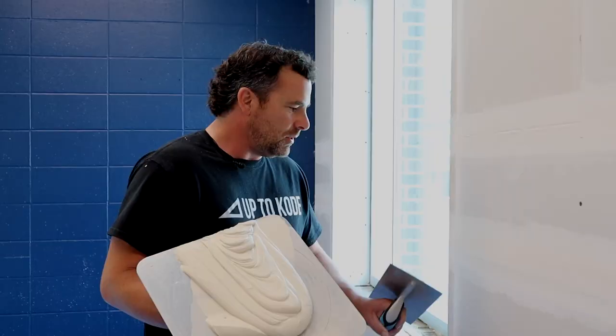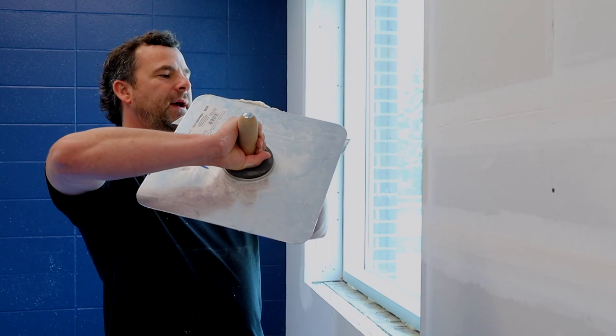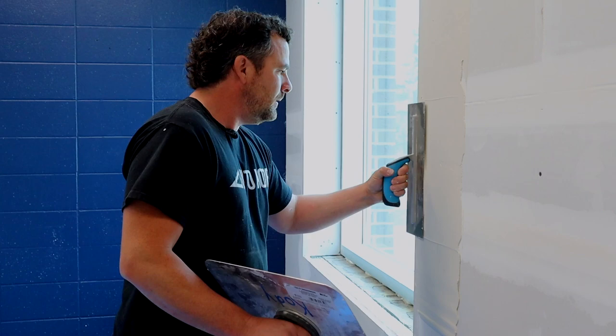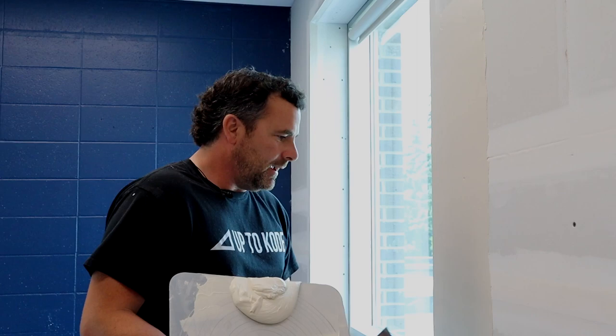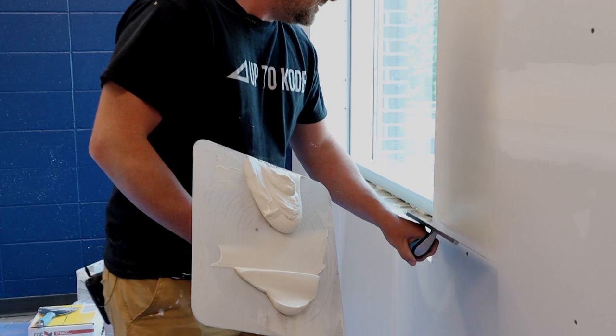In the 10-part series I go into detail on each step. Here I'll show you quickly how to coat the beads — the technique is slightly different. Again, application first: just get it applied, it doesn't matter if you're a beginner. Get close, cut the edge clean. Now the difference: I'm not going to float this. I want the corner bead nice, square, flat, and true. If you float it and push really hard, you'll bend and curve your trowel and the drywall will be curved. Stand it more square — you'll take off more material but leave it straighter. That's the key difference.